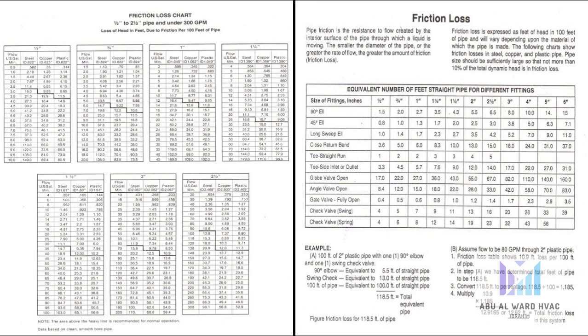At the design stage, attempts should be made to minimize the number of bends, expansions, and contractions in the pipe work, keeping the piping as straight as possible and the diameter the same. However, due to space constraints, this is not always possible. Any fittings or valves specified for the installation should also have a relatively low pressure drop. In addition, the diameter of the pipe work should be carefully selected, as smaller diameters will result in more friction.